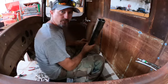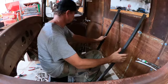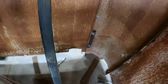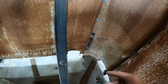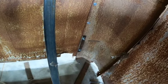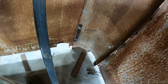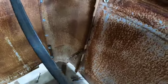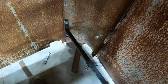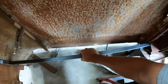Okay, we've got our square tubing cut for our side rails. So we're going to size these up here in a second. I've also got some plates cut and welded on the body supports right here and on the other side. Just to, we have an echo. Echo! Cab's getting filled up, we got an echo in here. So I'm going to tack weld these braces in. We will cut them a little bit long. So we will be able to come in and come into them like this, level those out, and start tying the front and the back together.